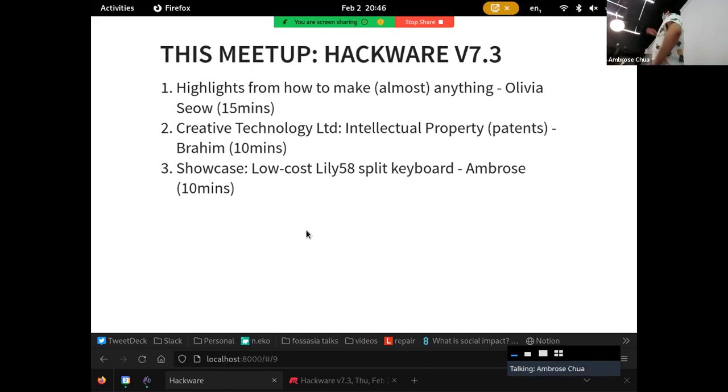Just like that, shift is sort of doing a layer in a way. Oh, I think they call it modifiers. Modifiers, that's also another word for it. The difference between a modifier and a layer is that modifiers are at the protocol level for USB. Layers are sort of an abstraction on top of that, which actually generate modifier combinations.